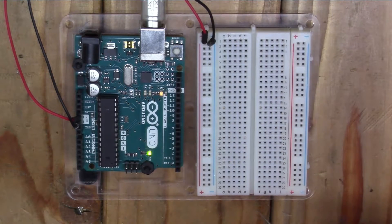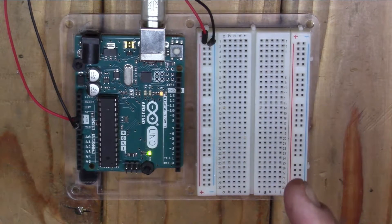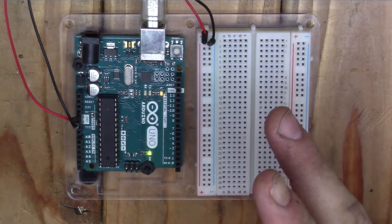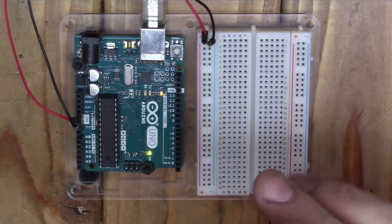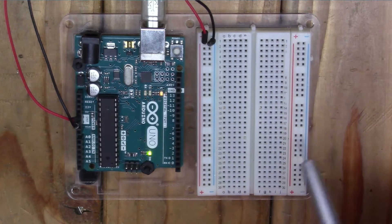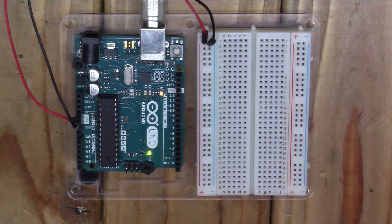Like for instance, the circuit that we're building today needs to accomplish three things. One, we need to fire the solenoid. Two, we need to use a potentiometer to control the flux of the solenoid. And three, we need a switch that tells the Arduino what position the motor is in. So we need to break those up into individual pieces and figure out which one is the most fundamental. In this case, the most fundamental and simple part of the circuit is to have the Arduino fire the solenoid.